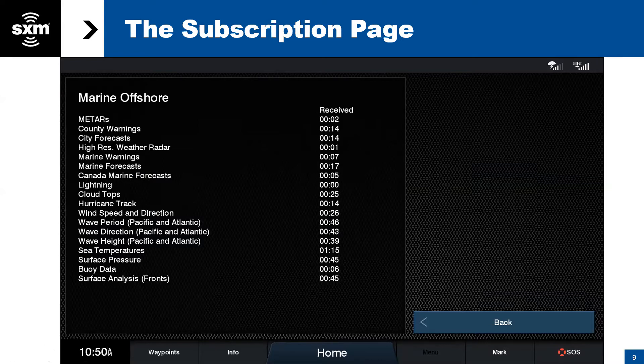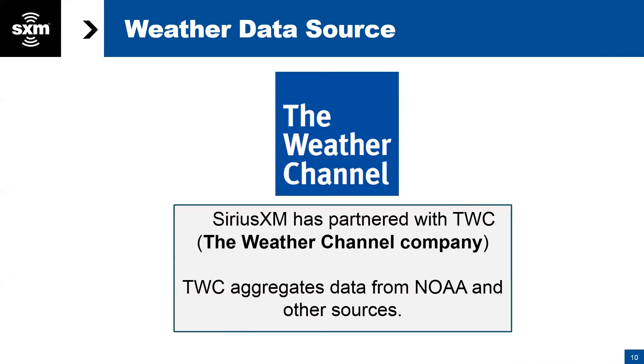Why is this important? Sometimes it can take up to 20 minutes to get information on your chart plotter from the satellites. So if you're not seeing weather radar on screen, it may not have shown up yet — check the timestamp. If you're not receiving anything after 20 minutes, you may want to check your signal strength. Typically you want three bars of signal, which depends on where you've placed your antenna and whether it has a clear view of the satellites.